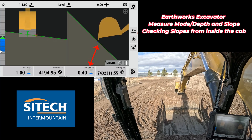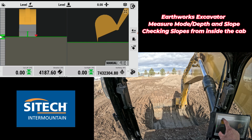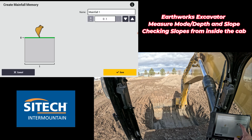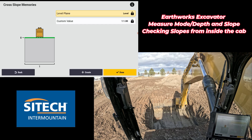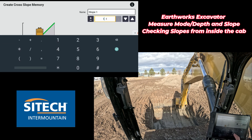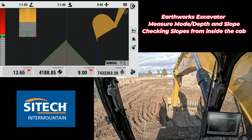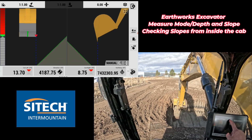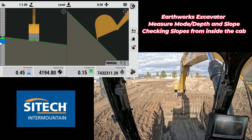If I put my bucket in the far corner of the footing and bench out a new elevation in the far corner, I can turn on both cross section and main fall. I tap main fall on in front of me, come in here and create a memory — a one-to-one out in front of me — save that and come out. Then from cross section to the right side, I touch and hold, go to the black box, and put a memory in for a one-to-one to save to the right. Then I put my bucket in the top corner on the left side and make a memory for the slope to one-to-one. With that established, I can reach out and actually start cutting down my slope.